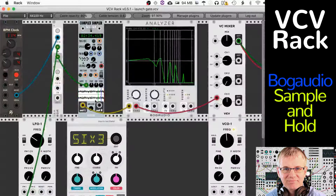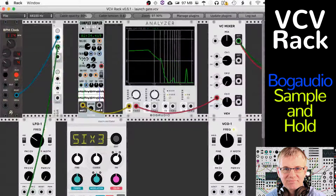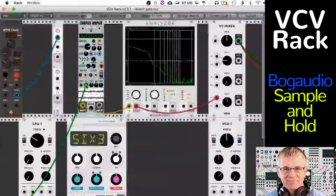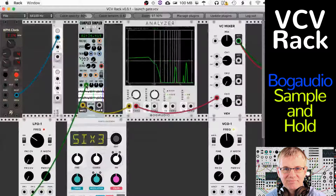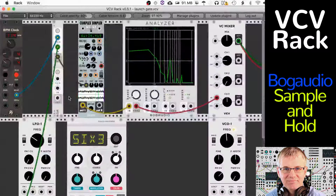This is changing the start position. You can see it's moving based on where the LFO is sitting. As the LFO slides back and forth across its frequency range, it's bringing the start time back and forth. It's stepping it. Now if I take the Sample & Hold out of that — watch that start-stop line — now it's smooth. You see? It's smooth. Again, if I take the Sample & Hold and run the same control voltage, you see it's stepping.